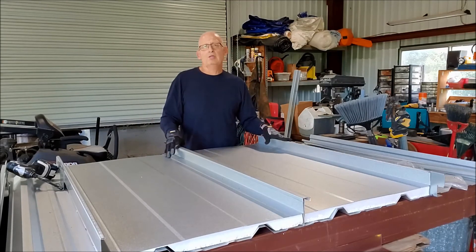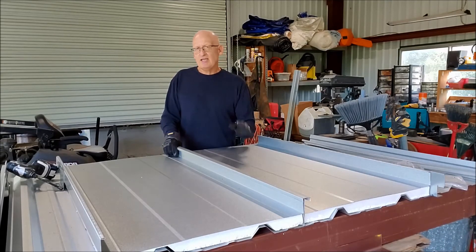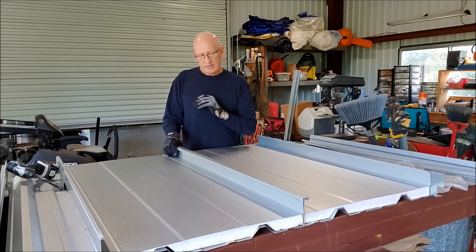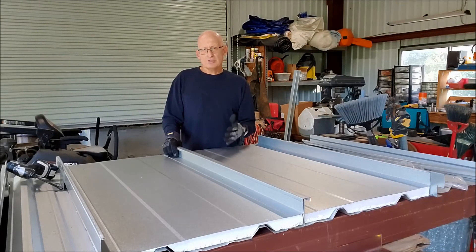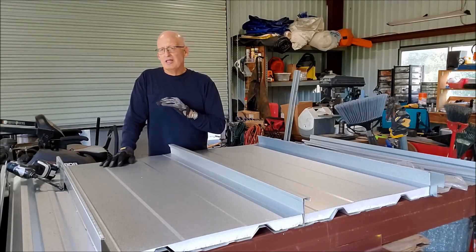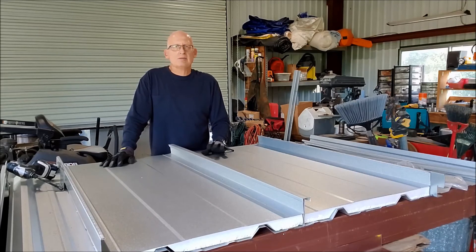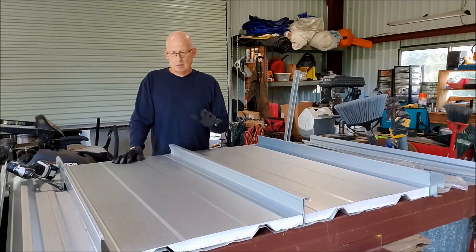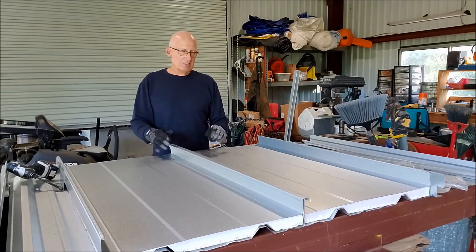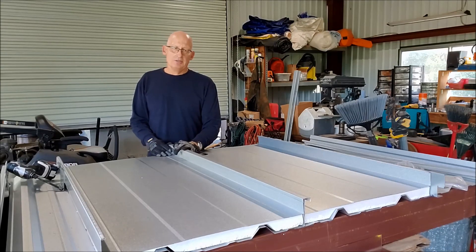Now you've got a beautiful roof. We see this thing go down in the neighborhood of 1,000 square feet per man per day on these jobs — great, fast installing system. It gives you individual panel replaceability. I don't think there's anything better out there for recovering an R-Panel, as long as you're not wanting to add a bunch of insulation and you don't have structural issues to start with. This is going to be the lightest system at about 1.3 pounds per square foot. We see this come in a little bit higher than single ply recover, but for a much better system. So keep this in your thoughts whenever you're thinking about R-Panel recover.